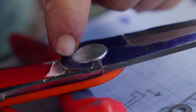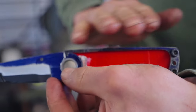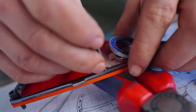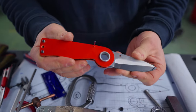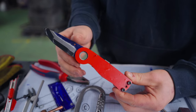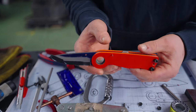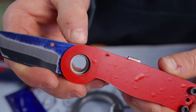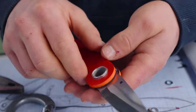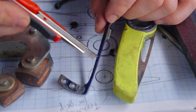It now fits in — check this out, it works. Or at least it locks; we haven't worked out if it opens yet. It locks in quite an attractive position — very tasteful. I ordered some 1.2mm stainless wire but until then we'll make do with a drill bit. It locks in the open position; I quite like the angle of the blade. The handle needs a few tweaks in shaping, but the first thing I want to tackle is getting this to spring, because pressing on the catch all day does nothing — it has zero flex.